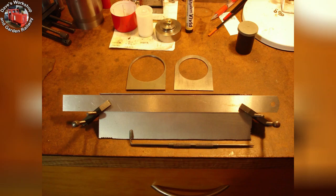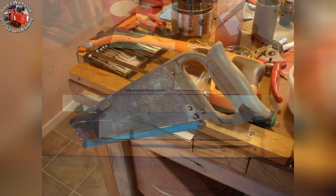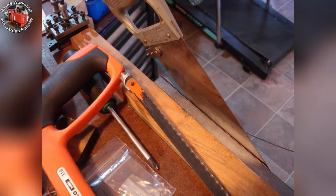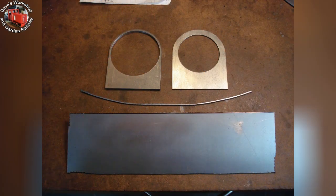Marking out the 1.6mm steel sheet for the smokebox wrapper. A thin strip needs sawing off to true up the edge. The Eclipse 55 sheet metal saw is perfect for this long cut. Now that I am wearing reading spectacles, I can saw right up to the line. That's the saw cut — now to file to the line for a straight edge. I was able to get the saw cut to 0.005 of an inch off the line.